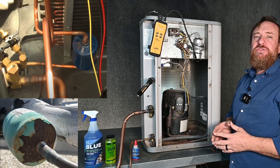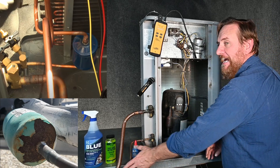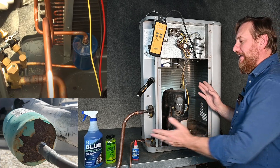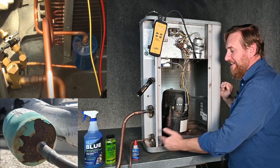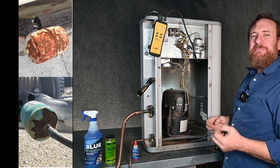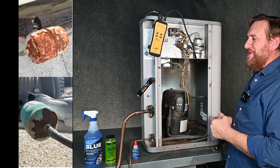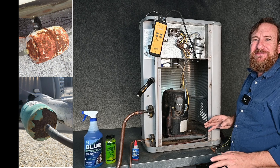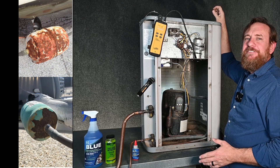Some units come with liquid line filter dryers inside the condensing unit. So if you see a liquid line filter dryer outside and another one inside, that should automatically be a red flag — that's already going to be a restriction even if they're both in good shape. This is going to be the one that gets dirty and the other really won't be doing anything. If you see two liquid line filter dryers, that's a red flag — make sure there's not a third one inside, because I've seen three in one unit before. The customer called because the last company kept having to change compressors, but this filter dryer was completely stopped up and also leaking refrigerant — two big problems all in one.